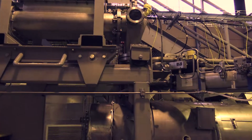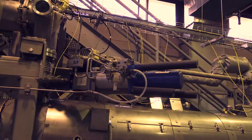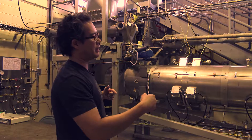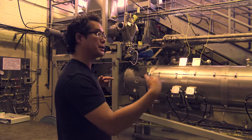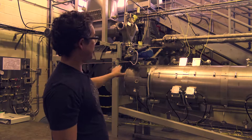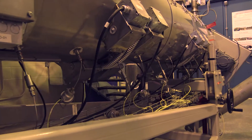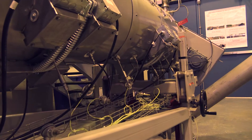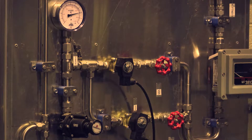Inside the kiln, it's a cylindrical tube reactor, and in the middle there are these paddles. We've got control over the speed that the paddles are turning, and we've got these five heating zones, and we've got control over each of these individually. Between the rotor speed and the angle of inclination or declination, that's going to impact the amount of time that the biomass is in there.